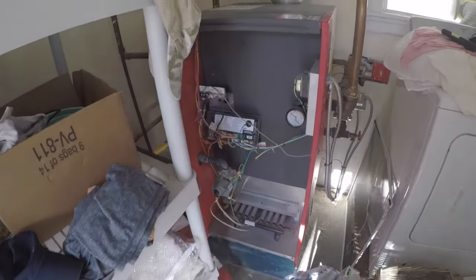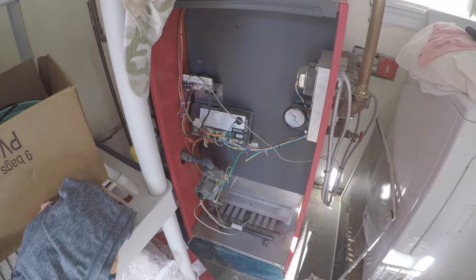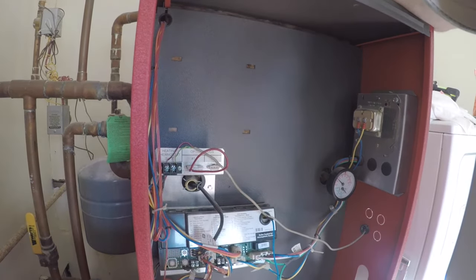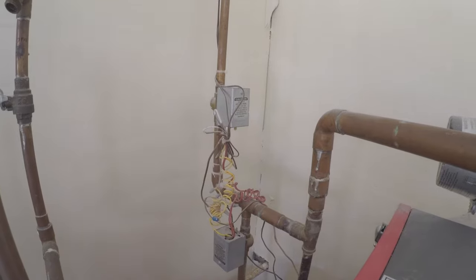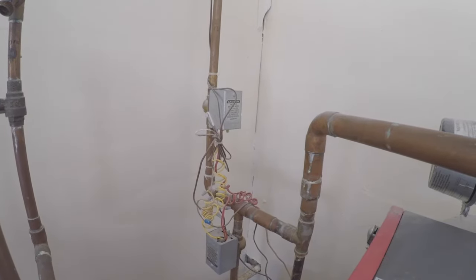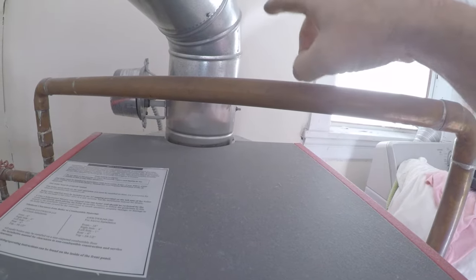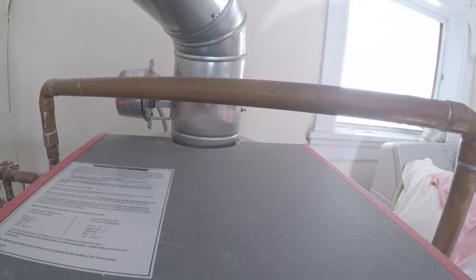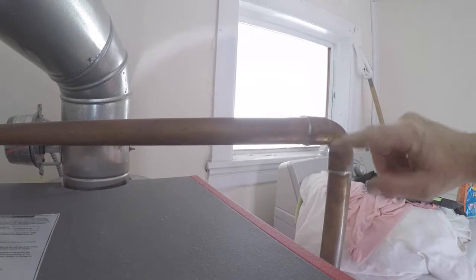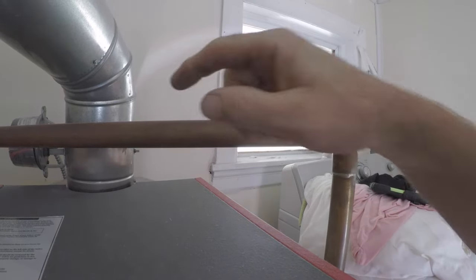All right, folks, we're coming in. Little beginning of heat season turn on. And we turn the heat on, which is two zone valves, Honeywells, which opened up and fired right up. And then this pipe is airbound because it hasn't been purged. Hear that? This is trapped. Comes off the feed, goes across.